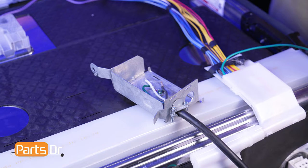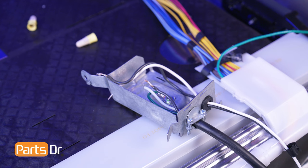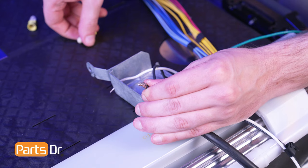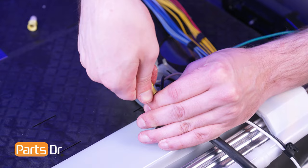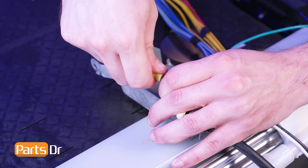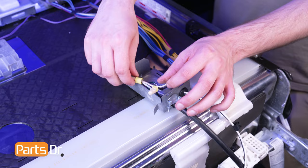Next, locate the two power cables and route them through the terminal box and pull until the retainer snaps into place. Join the two black wires together, bearing in mind that it is best to have approximately one-eighth inch of stranded wire above the solid wire. Note that you should not pre-twist the wires when using wire nuts. Insert the pairing into one of the wire nuts and twist it to secure the connection. Then repeat the same steps to connect the white wires. Gently tug on the wires to be sure both connections are secured.